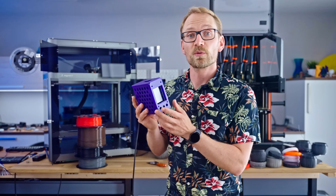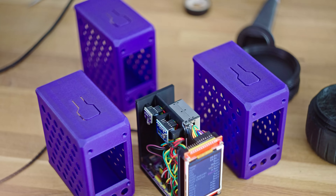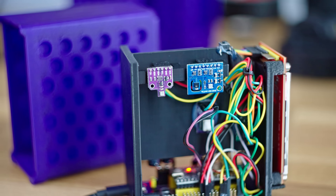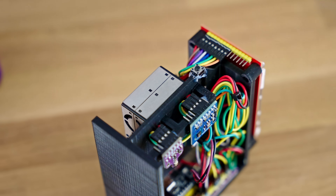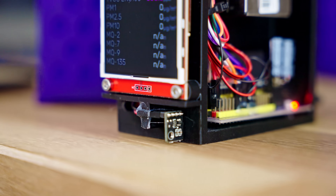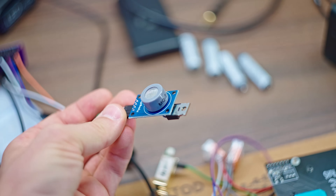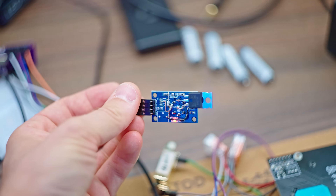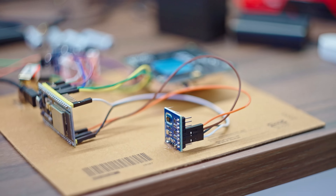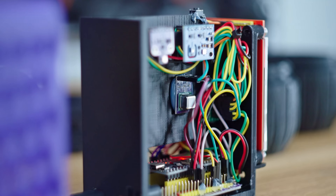To get at least some insight into what my printers are doing, I built myself this sensor box. It's an ESP32-based sensor array with two different brand VOC sensors — one from Siosense and one from Bosch — a combined particle and formaldehyde sensor from Plantower, and a temperature-humidity sensor. I've also got a couple more sensors on separate ESPs: one is a modded MQ7 carbon monoxide sensor, another particle sensor from Nova Fitness, and a second Siosense VOC sensor. There's also a CO2 sensor, but these printers don't breathe, so that one didn't do much.